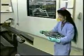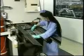Now we'll do the production run. A particular assembly may require additional hardware, such as solder plows or stiffeners. These should be attached to the assemblies before they're loaded onto the conveyor. The hardware keeps solder from flooding the top of the board on certain types of assemblies.